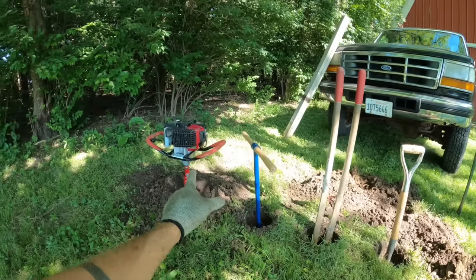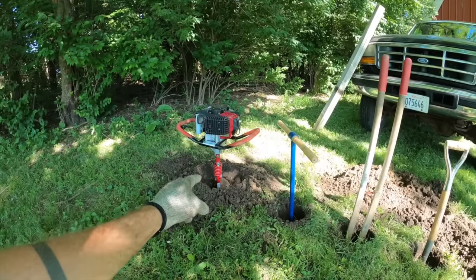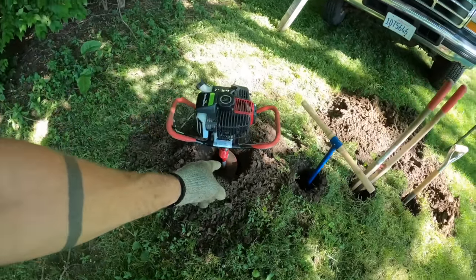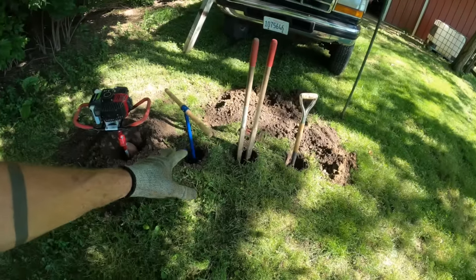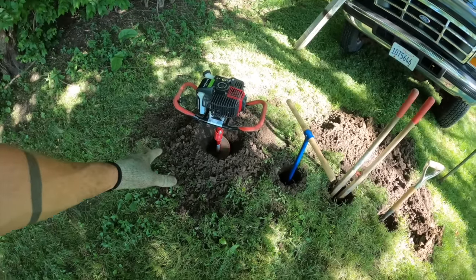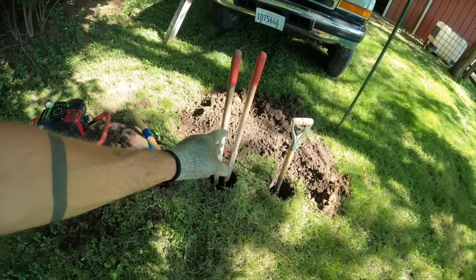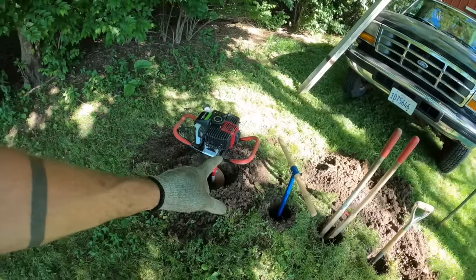Tomorrow I'm building a fence and I'm going to bring the power auger with some backup, but I'm hoping to dig all 20 posts with it because it's faster and pretty much easier — it's still a workout, but it does a better job. You end up with a big hole, which I like because it means more concrete and a stiffer post. And let's admit it: if you look at these four holes, one of them does not look like the others. The power auger makes a mess, blowing stuff all around your hole that you've got to clean up, whereas the hand tools let you contain your dirt on a tarp or cardboard and cart it away.